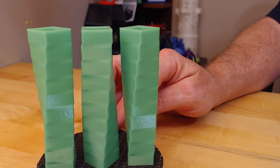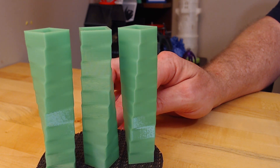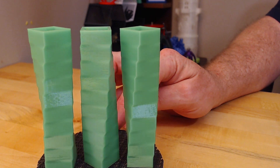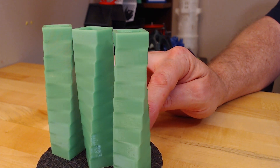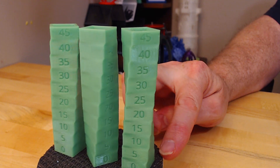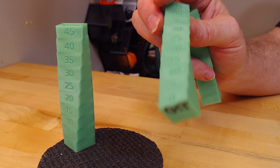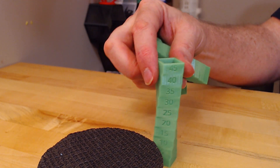And as you can see, looking at this — I mean, look at that finish. It's gorgeous. And all of them are identical. There is literally no change, no difference. One was with Repetier, one was with Octoprint, and one was straight off an SD card. And again, no ghosting either. They were beautiful. Just a simple little print — SD, Octoprint, and Repetier server. So there you go.